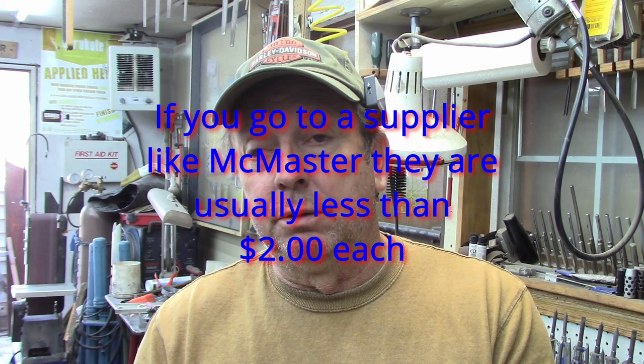Those bushings in all of the machines are readily available, whether it's counter shafts, or the feeds on the shaper, the feed bushings through the linkage arms, that type of thing. Those are all readily available. Atlas did not use anything proprietary on those machines. They use readily available bearings and bushings in all of their machines, to the best of my knowledge.